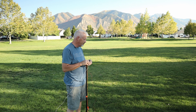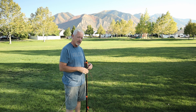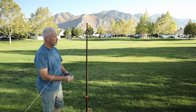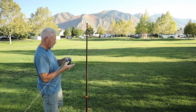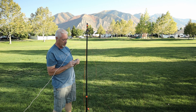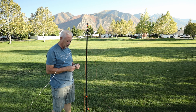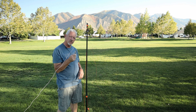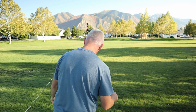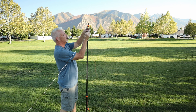One of the reasons I want to show you this today is that you can be resourceful when you're out here doing this sort of thing, and that makes it a heck of a lot of fun. If you were in an emergency situation and needed to do this, it's good to have some practice making these things so you can get yourself operational quickly. To save some time I'm going to hook up my RG-174 to the center insulator and then put up the ends. It's always good to have at least one barrel connector with you whenever you're out — you never know when your coax breaks or you need to hook into someone else's setup.